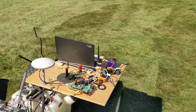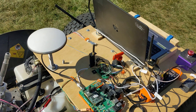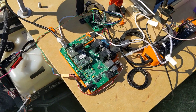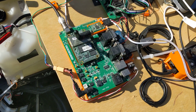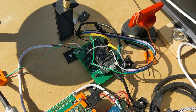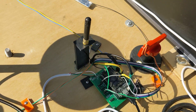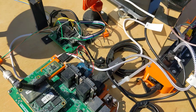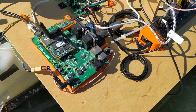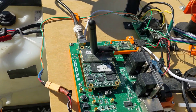Pretty much you can only see what's on top, there's some other boards on the bottom. The white globe is obviously the GPS antenna - survey grade. This is the GPS module where you see version 3.87; the rest of that board is a development board. That board is a microcontroller - an ESP32 microcontroller with LoRa built in. You can see the LoRa antenna.